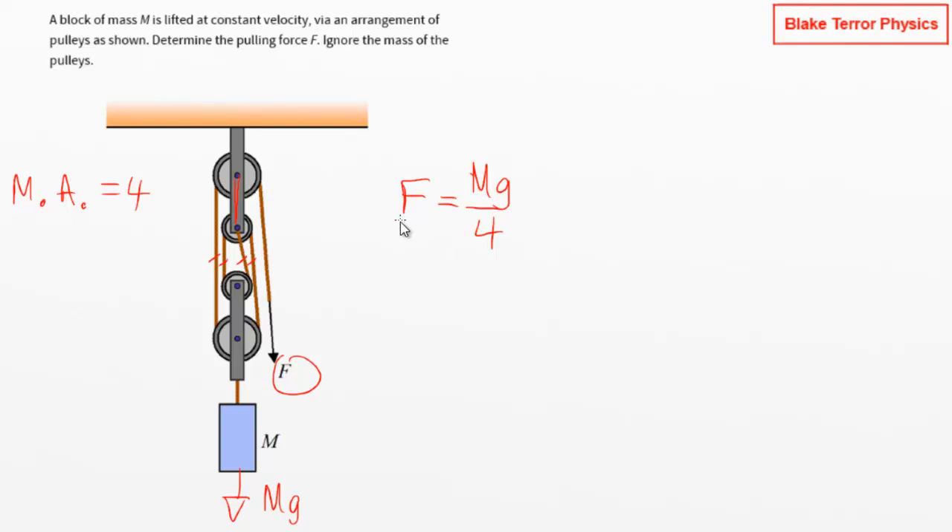That assumes 100% efficiency. The inefficiencies are obvious: every time we wrap the rope around a pulley we get friction. There's also the weight of the movable part — we're lifting those two bottom pulleys plus their connecting piece. Many of these pulley systems were used on boats at sea, and when ropes get wet they become very heavy. Although it seems like we can keep increasing mechanical advantage with longer ropes and more pulleys, eventually they become too inefficient — too much heavy rope, too many heavy pulleys, too much friction.